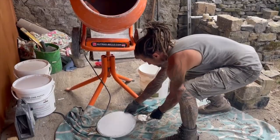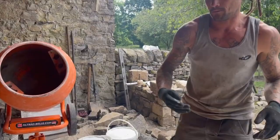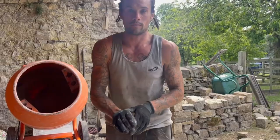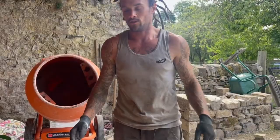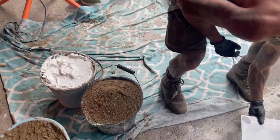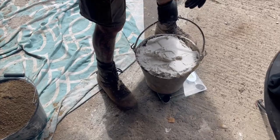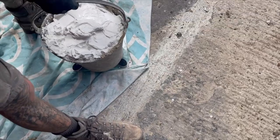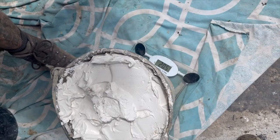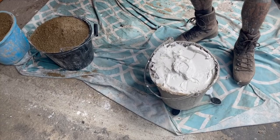It's very important when you are batching your mix to batch upon weight, not volume. When we're mixing cement we can sometimes gauge it with a shovel — you can't do that with lime because it will affect the performance of each individual mix and it will affect the finish aspects of what the mortar looks like. So we've weighed this: twenty and a half kilos. The bucket itself is half a kilo, so we know we have 20 kilos of lime putty in there.